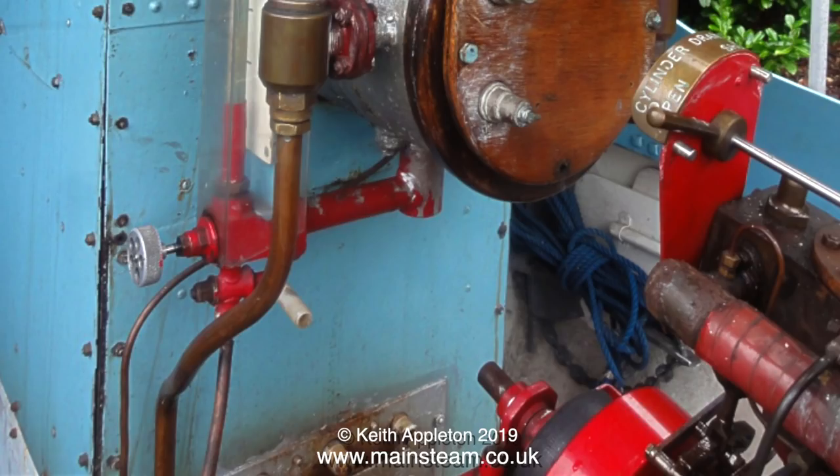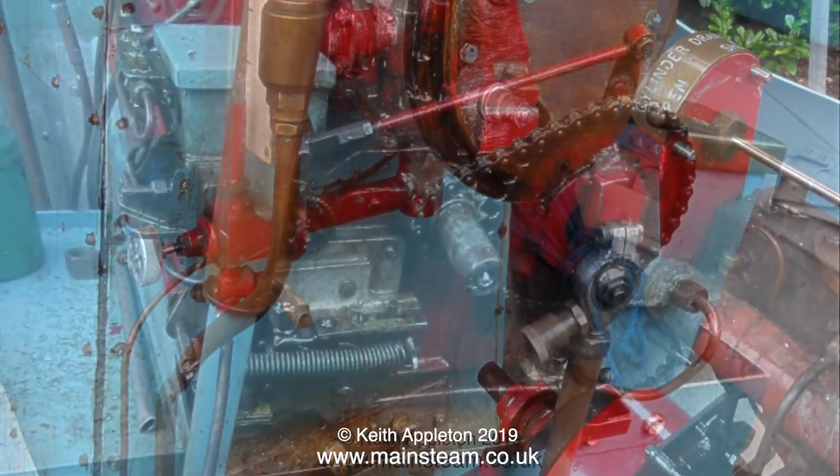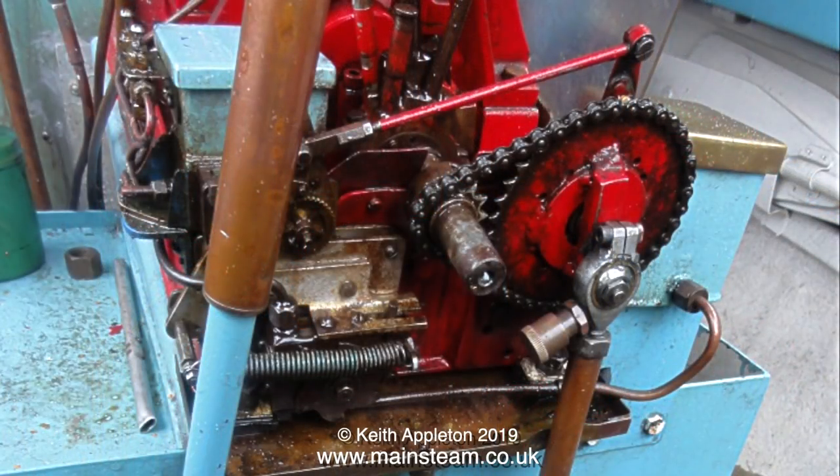In this photograph again you can see the water gauge, the check valve or clack valve, and the lever on top of the engine - in this position it opens and shuts the cylinder drain cocks. I've shown this view of the engine before on the bench and it's quite ingenious: a chain from a sprocket on the crankshaft drives a larger sprocket which has a cam on the back of it that operates the oil pump for the cylinders. This cam-operated lever also operates the oil pump that pumps oil to the main crankshaft. The lubricator for the crankshaft is spring operated, just putting positive oil pressure into the pipe that feeds oil to the crankshaft.